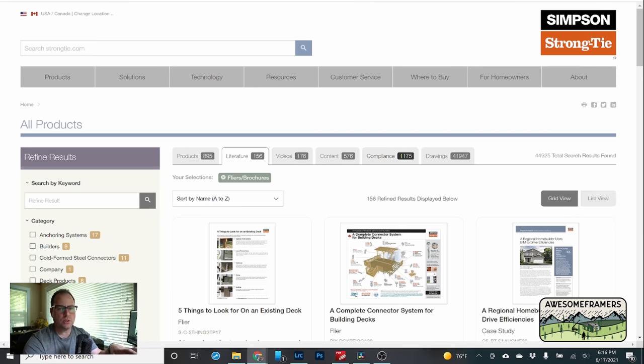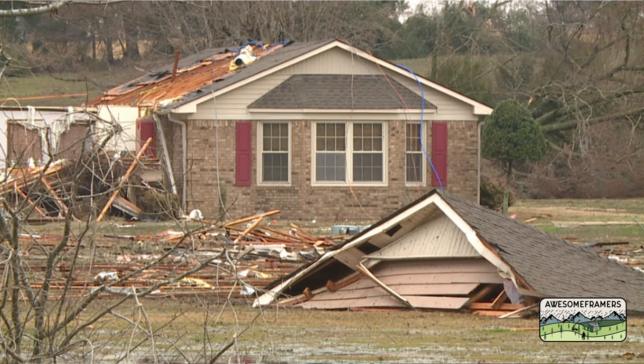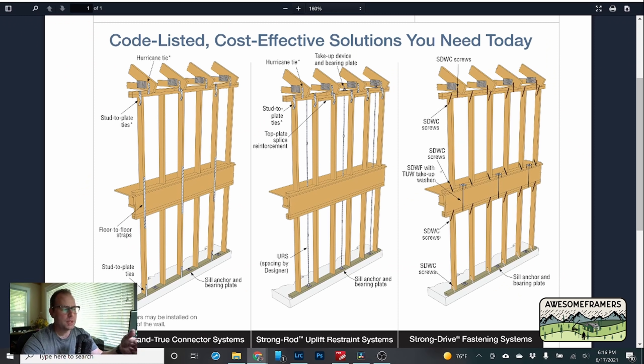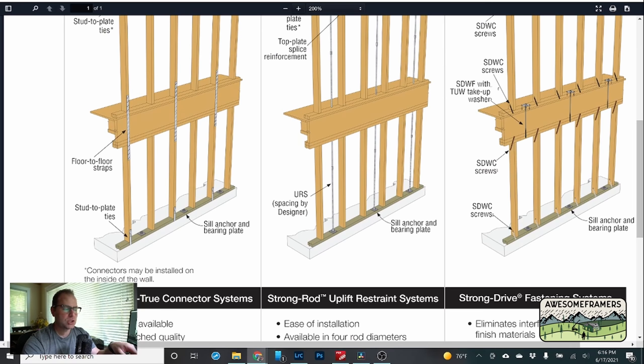Here's why I get excited about this subject: it used to take a fair amount of time to apply all the hardware needed so the roof stayed on the house. On the left-hand side you see hurricane ties connecting the truss or rafter to the top plates. But it doesn't do any good to just connect to the top plates if the top plates aren't adequately connected to the studs. Working down toward the foundation, on a second or third floor we need tension ties or floor straps, and at the very bottom the mud sill needs to be anchored or bolted to the concrete.